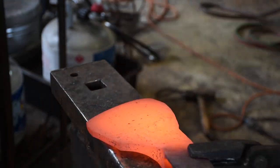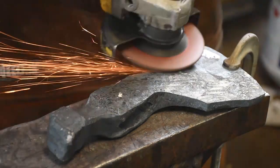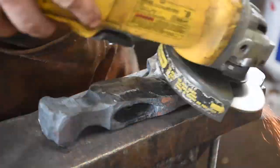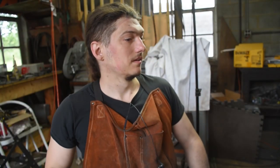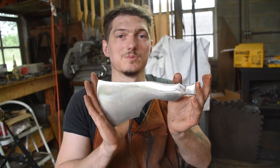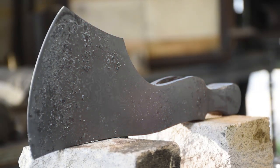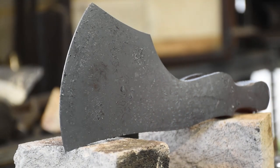I'm going to be moving to the grinding after this, once it's as straight as I need to get it. And you might think it's a little soon for that, but because it's Damascus — because there are a lot of layers that are parallel to the surface — I want to grind down into it. That will reveal the pattern that is currently parallel to the surface, and some of that will come from grinding down those rougher forging marks. Now we heat the axe up three times and let it cool down three times — three normalization cycles to improve the grain structure of the metal. And then we're going to heat it back up and get ready for the quench.